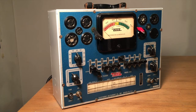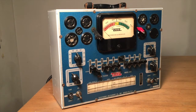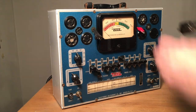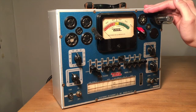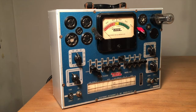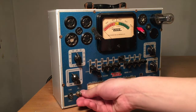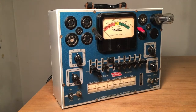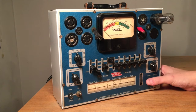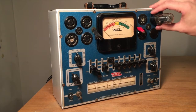One of the first things I did when I started this project was to test out the tubes I have in stock. I happen to have a 5Y3GT — a couple of them. I'll go ahead and plug the 5Y3GT in. It takes a moment to become fully active because it has directly heated cathodes. It tests as good. That's only testing one of the diodes — there are actually two. I'll switch to the other selector and test the other diode. That one's also good. So the 5Y3GT is good — I can use that one.